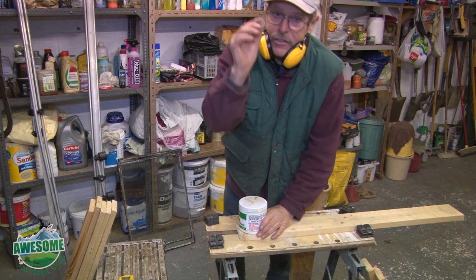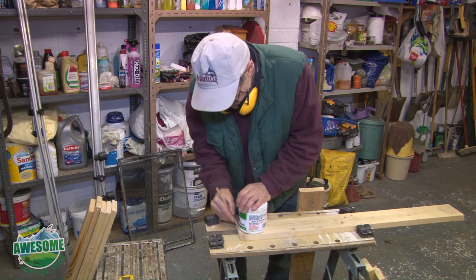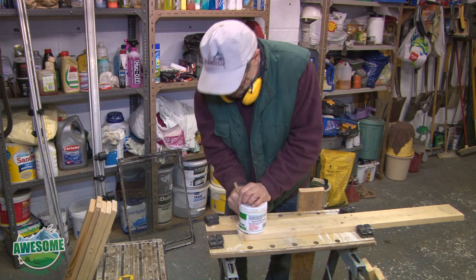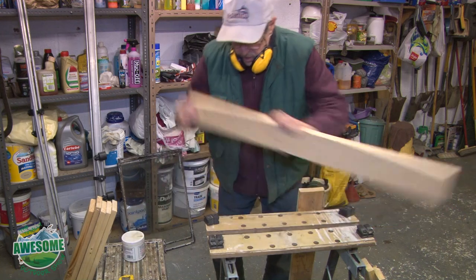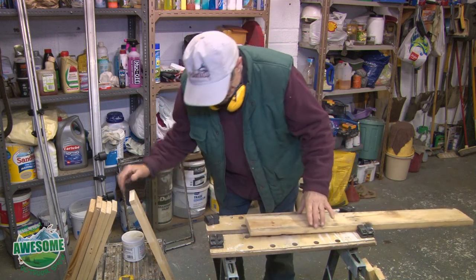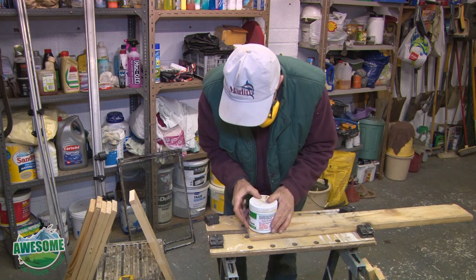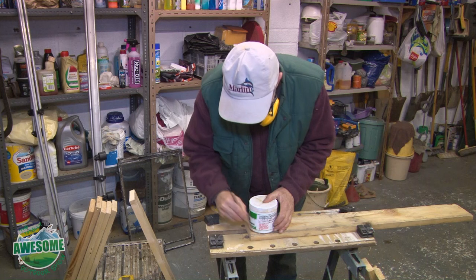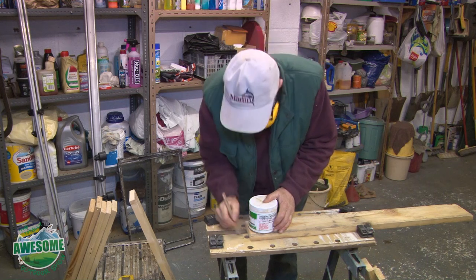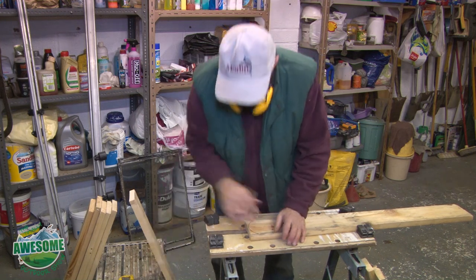Just come, when you do cut this, about a millimetre or two in from the top. So I'm just going to mark this one. Use one of those nice carpentry pencils, and you can see what you're cutting with the jigsaw. And then you can do the same with the actual panels of picket fence. So if you do this now, when you put it together, I find it's easy to do them individually. Just come back about a millimetre or so from the top. Almost, again, it's the thickness of the pencil. So the pencil goes right around the edge of the wood. It doesn't actually run off and slip off. That's difficult to trim off. You want a nice, smooth cut when you do the jigsaw.